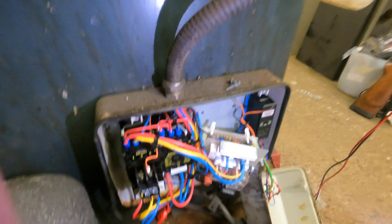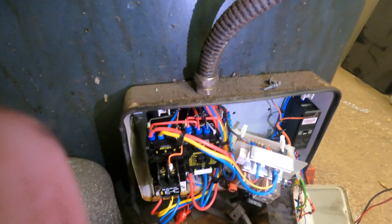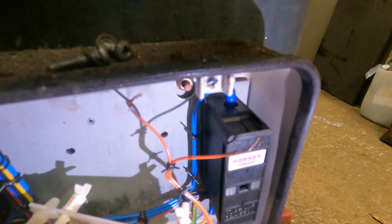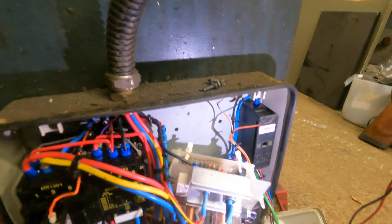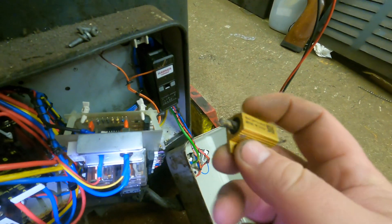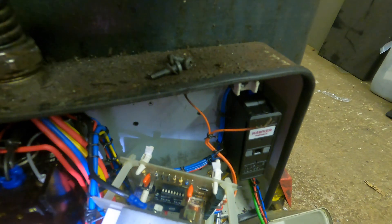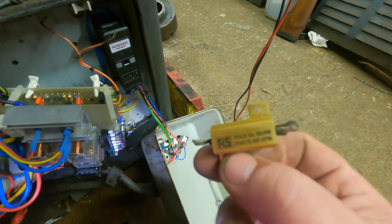So I came to this now — this is the emergency stop system on this lathe. I went through it all and checked, and what I came across was two orange burnt wires. It had a resistor on it and the resistor has blown out, which I'll show you. This little resistor has blown — not sure why — but the two wires that were on either side of it have actually burnt and melted. So I'm guessing this is the culprit and I've ordered a new one.